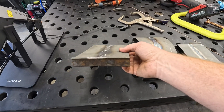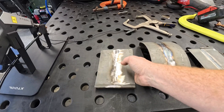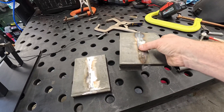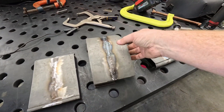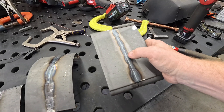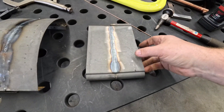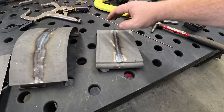I really can't get over this — it just came out so nice. I just need to do a very little bit of cleanup to dress that weld down a hair and this thing is ready for filler, or honestly I could probably just metal finish a lot of this. Here's a look at all the panels again. This is the MIG — I just really had a heck of a time with this, it's just not my thing. TIG I think came out great, it does need quite a bit of cleanup though compared to the laser, but it was much less than what I'd need with MIG. And the laser — if I could have done that the whole way I really don't think this would have moved much at all.